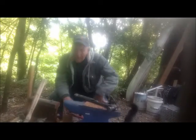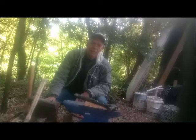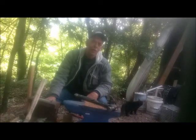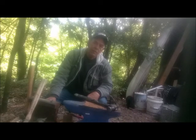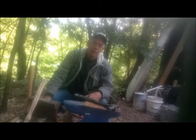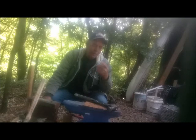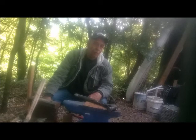Good morning. I've had a lot of people ask if you can do knife making without a forge. If you're not going to do any other blacksmithing, you really don't need a forge. The one thing you need is some source of heat to heat treat. You could use a propane torch with map gas or a acetylene torch, but you need to heat the steel to a glowing red and then quench it in oil. So you need a source of heat, but it doesn't have to be a forge.